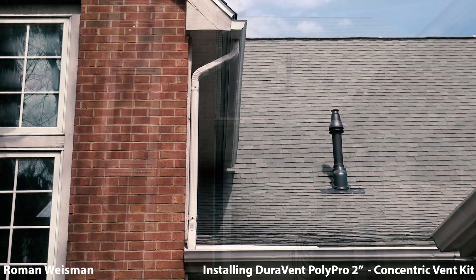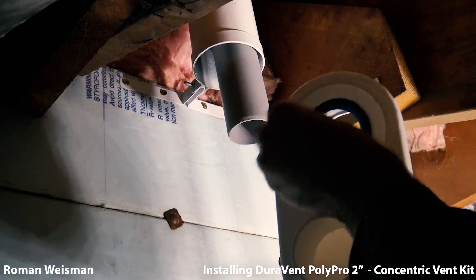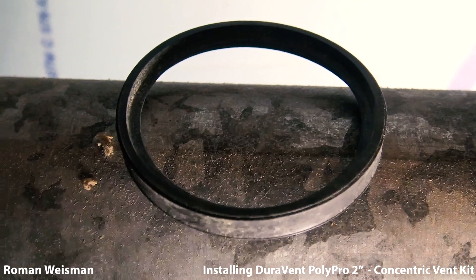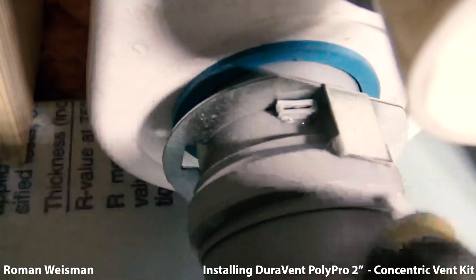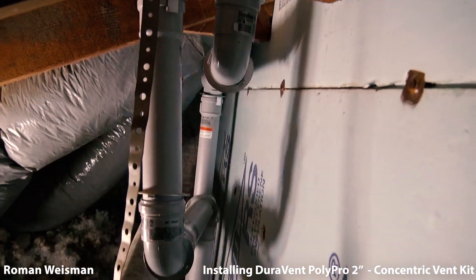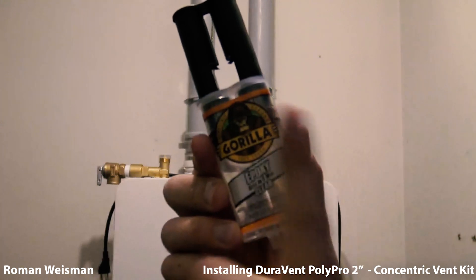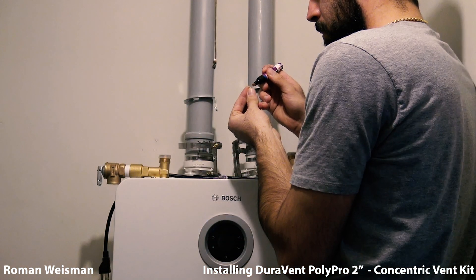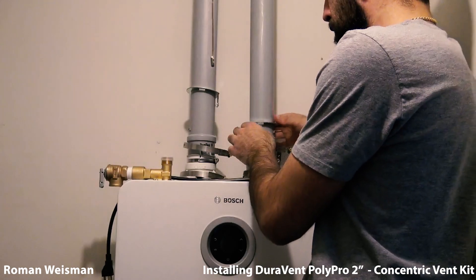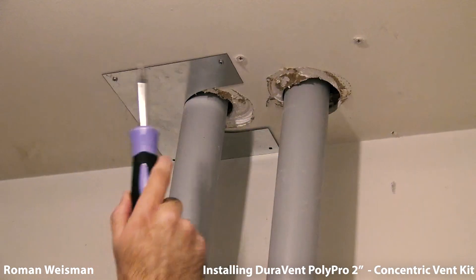There should be a minimum of 3 feet from any opening. Using gaskets on both sides — all pipes must have gaskets in them. When the length is too long, I cut, remove the little fitting, use the right glue and glue it back. Fastening the screws for a secure grasp. Fire stop. And fixing the damage.